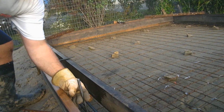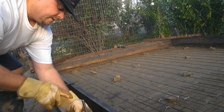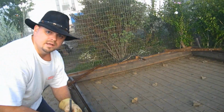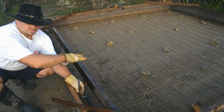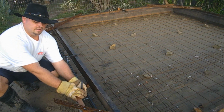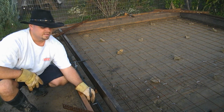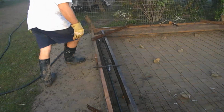So these I'll put in every 2 feet, which might be considered overkill, but we have a lot of wind, so I'm not taking any chances for a buck something a bolt. So we're going to put these in about every 2 feet, okay, all the way around this wall. Later, when I build the 2x6 walls on here, the bottom of the walls will be drilled out to fit these bolts in the position they are. So once the walls are stood on here, then we'll put a washer and a 1/2 inch nut on there and bolt the wall down. And what that does is it just, again, more insurance that the wall's actually going to stay on the foundation. You know, in a high wind storm, you don't want to take any chances. So this is that insurance. These are only $1 something each, so use lots of them. That's my philosophy.